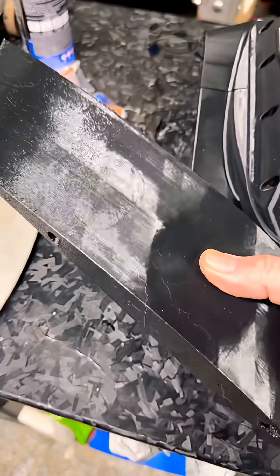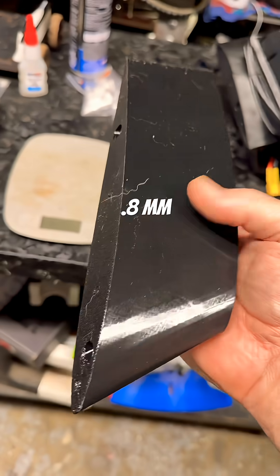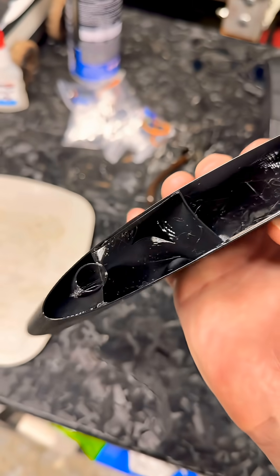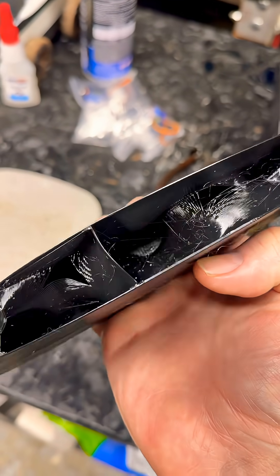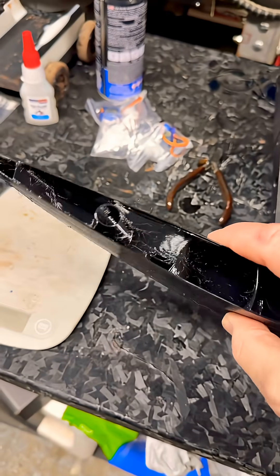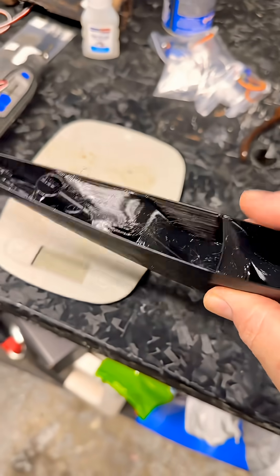What I wanted to show you on this is I had a 0.8mm nozzle that I wanted to try out. And you can see that's some thick... that's 0.8 — it's almost a millimeter. And I did a 2% gyroidal infill.